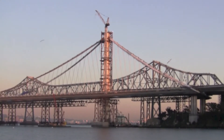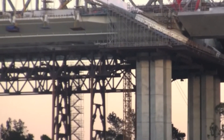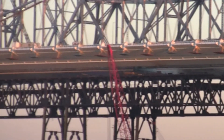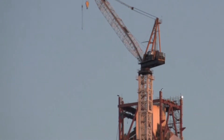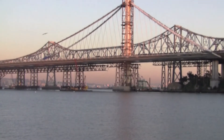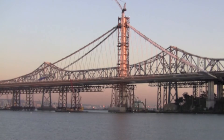The cable that you see there is actually two giant loops. The cable starts up at the tower, comes all the way down, and goes around the saddle assembly there. It's fed back underneath the bridge along its entire length until it gets to the other end, where another saddle reverses its direction and brings it back up to the top of the tower. Rather than being anchored to the earth or a foundation at each end, the cable just goes in a giant loop and pulls back on itself — that's where the term self-anchored suspension span comes from.